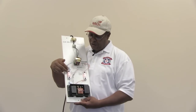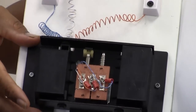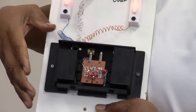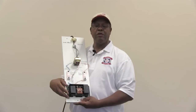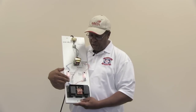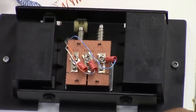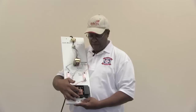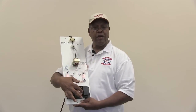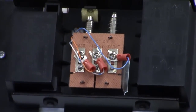It leaves the doorbell and goes down to the chime. This is a chime that's in your hallway or somewhere centrally located in the home so that the homeowner can hear the doorbell when it rings. In this chime the low voltage wiring comes in — one is hooked from the other side of the front doorbell to the chime, the other is hooked to the other side which is the rear doorbell. And there is a connection in the center which is not currently being used.